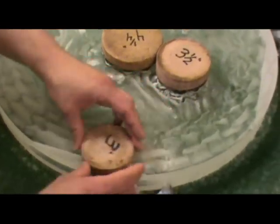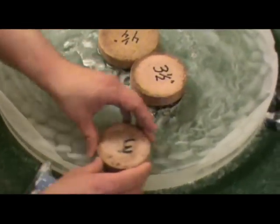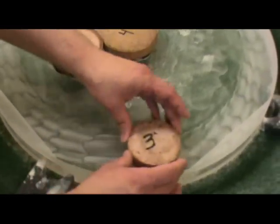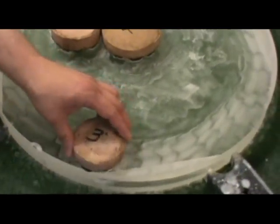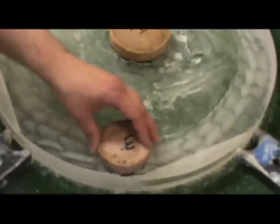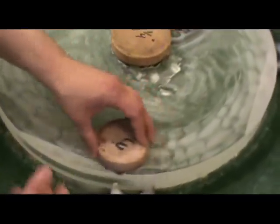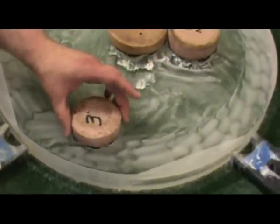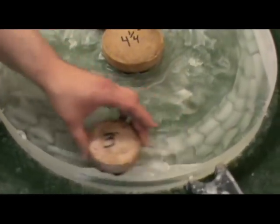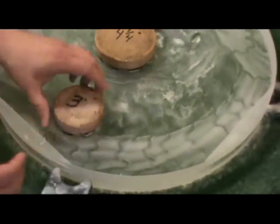Now there's one other trick for helping to blend your action. In this situation, I don't want the correction to go in on the left-hand edge of where this little pitch lap would go. So what you can do is V the stroke during the processing time. That means I'll stroke one, two, three, and then stroke toward the center — one, two, three, inside — and repeat. I'm exaggerating it here; you don't want that inside stroke to actually be very big.